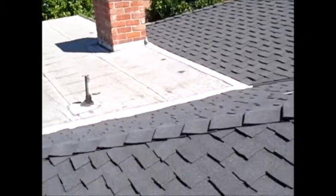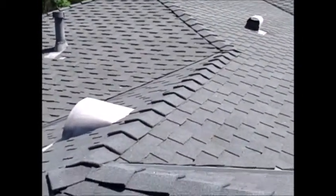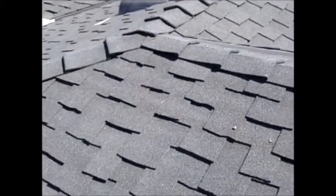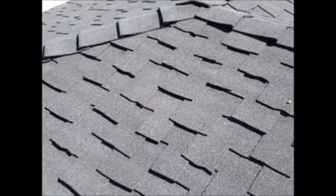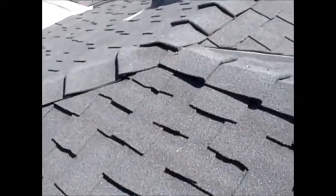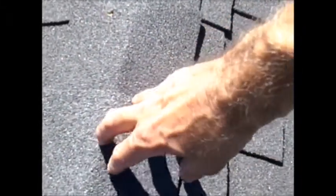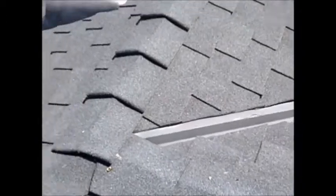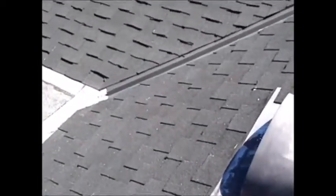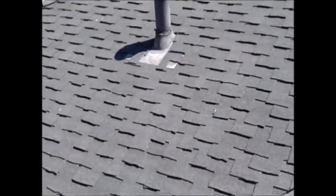So on your slope part of the roof you have this composition shingles. It's high profile. Typically they'll last 25 to 30 years. And at the very top of the roof, we call this the ridge cap. It's where the 2 roofs come together. And usually this burns out or gets deteriorated at 8 to 10 years. It's in pretty good shape today. So I'm trying to age the roof. So it's probably going to be under 8 years old.